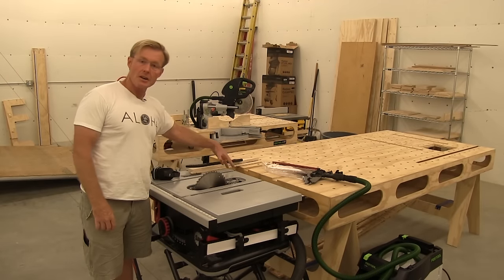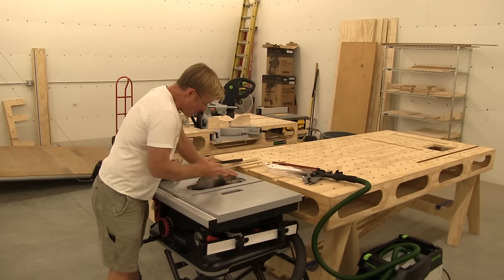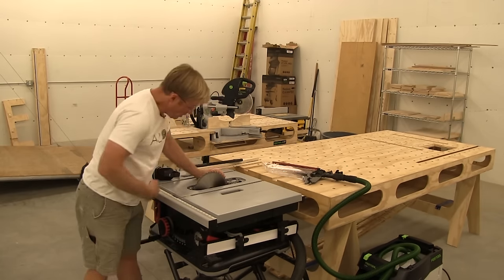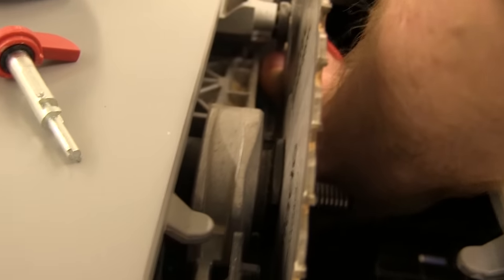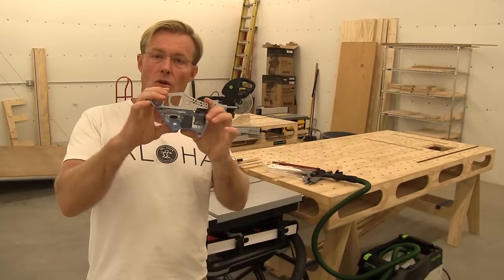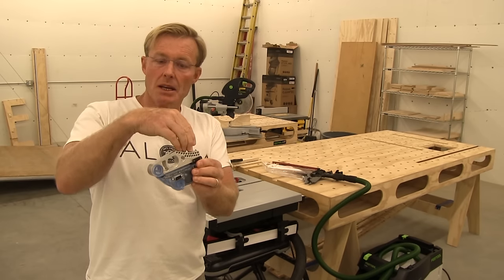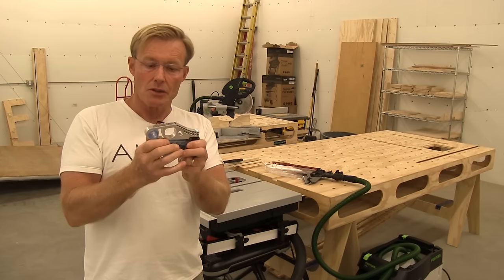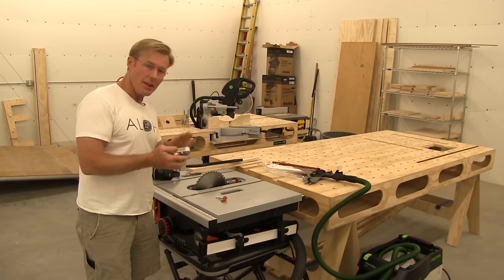Changing the blade does take two wrenches. They come with the saw and are mounted on the back, with an area to store extra blades. The SawStop mechanism that will stop the blade is removable without tools — it just snaps in. There's a flip-up knob and a pin that comes out, and then the mechanism slides off. It has electronic pins that you see when you're putting it in. This is a one-use item: if it's ever tripped, the aluminum and the blade fuse together, destroying both. You simply purchase a replacement cartridge and blade and remove them as one unit.